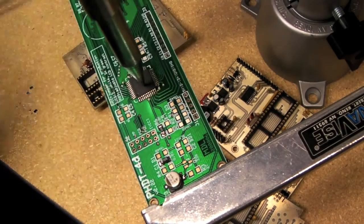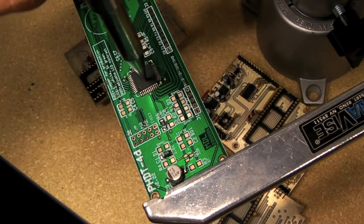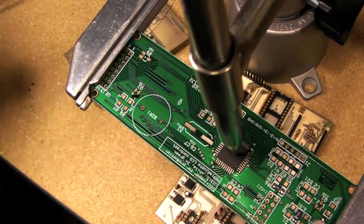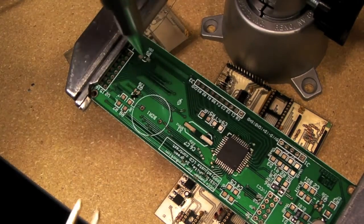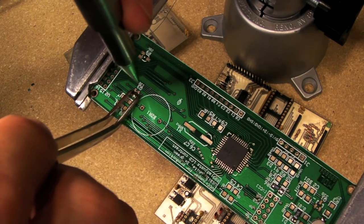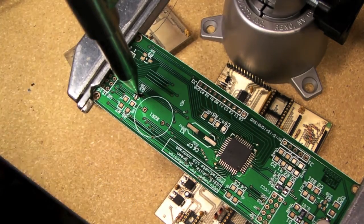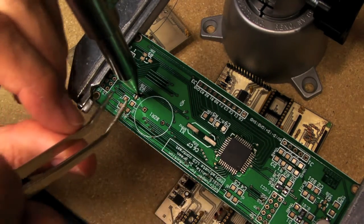Take that off. And I'm going to demonstrate it too on a small component like one of these transistors. Now, one thing that I should probably tell you about it, when I designed the PCB, I learned after experimentation that if you're going to solder these tiny transistors on here, you want to give yourself a little bit bigger pad to work with. Usually that just means lengthening the leg of it a little bit. So we get it placed right where we need it. Need to check the back side. Need to scoot it forward a little bit.